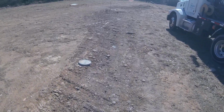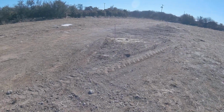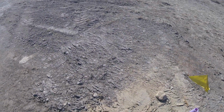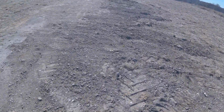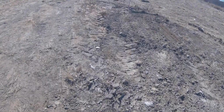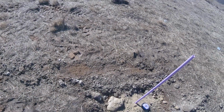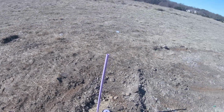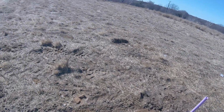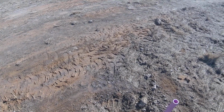Now what we're gonna do is go measure out the distance between the 2 spray heads. And we do that just to make sure that they don't overlap and don't oversaturate the soil, which is considered the final form of treatment. So with my little wheelie deal here, set to 0, find the midpoint, and just go. So 62 feet in between two spray heads, and I do believe that the spray heads have a radius of about 25 feet, so they have plenty of space between each spray head, so they're good there.